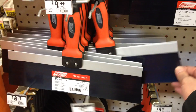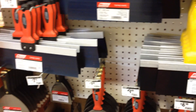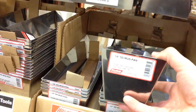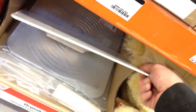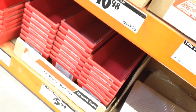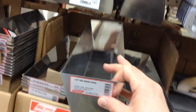For knives, I like to use about three sizes. I get the widest one I can find — these look to be about a 14-inch blade. Then I'll get about a 6-inch, and then just a small one. You can have a pan for holding your mud. There's also a tool called a hawk — if you're more of a professional you'd use this. It's a handle on a platter; you hold it and put your mud on it, then use a trowel to fill in your joints and cracks much quicker than using a tray with a knife. If you get a long knife, you'll want a tray that's long too so it fits.